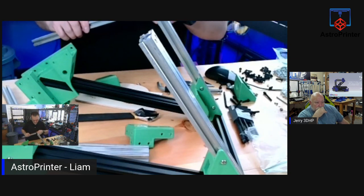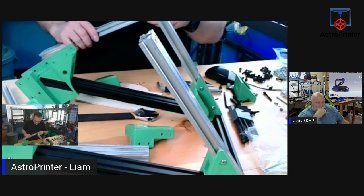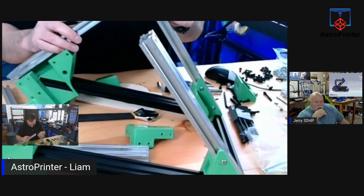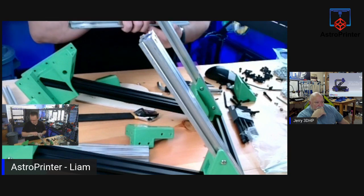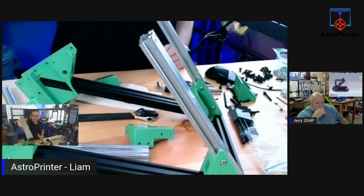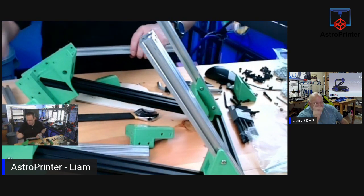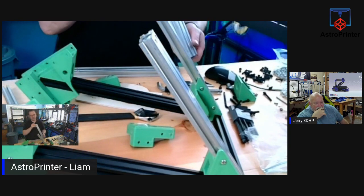Oh, did I speak too soon? It's not perfect. But it might work. Let me try. And because of the holes by your right hand that bolt to the other part, they're not flipped around backwards, right? No, the bolts are facing outwards. You see they're countersunk to allow the bolt head to go in. Okay, so I don't have four holes in each end. So that other piece that doesn't work isn't flipped around the wrong direction. No. There's only one direction that has the tapped holes.